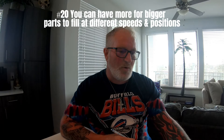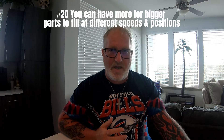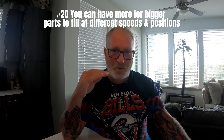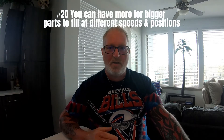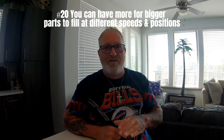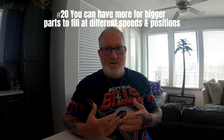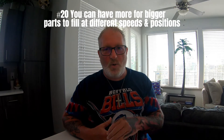Number 20: why do you have more than one injection pressure? On older presses you only have two stages on timers — first stage or fill, and second stage or hold/pack. But newer presses now have multiple stages, so you might have five stages of injection and five stages of hold or pack. They do that so you can fill a part differently — you can go slow starting out, then speed up, then go slow again before switchover. Some parts are huge and you may need to fill slow at first then faster to get into it.